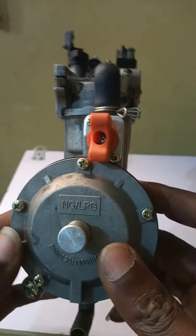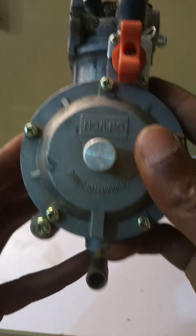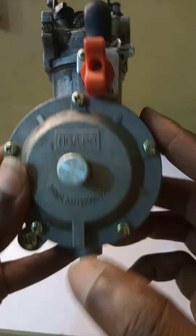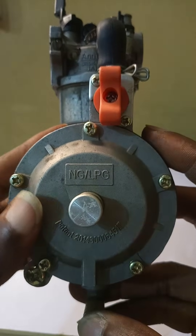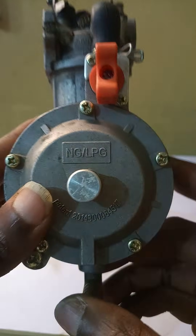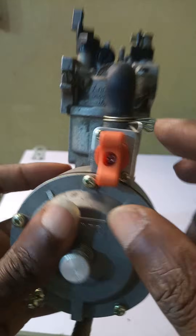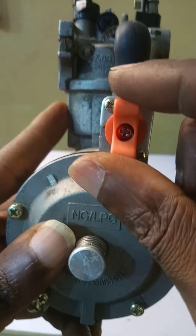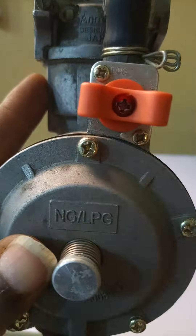When using alternative energy such as natural gas, plug the hose in here to the regulator of your cylinder. If using cooking gas, plug the hose from your cylinder here, but make sure the hose is plugged to a domestic regulator for safety reasons — do not use an industrial regulator. After plugging your hose, use this pressure port valve to purge so the generator can start. When this valve is upright it is using LPG, and when it is sideways it is running on CNG.